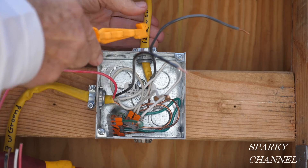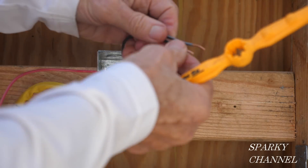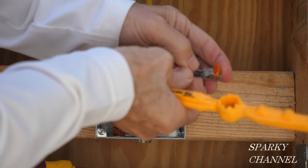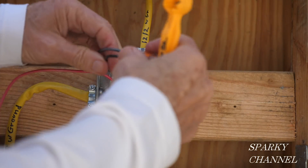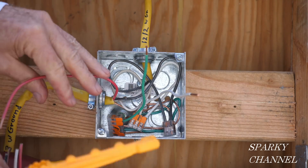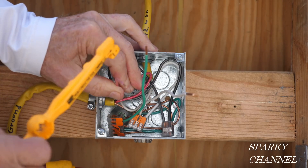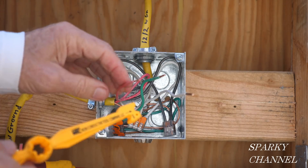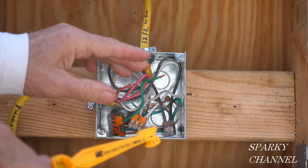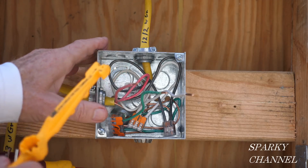This is the cable that brings the power into the box and here's its black wire — this is the line wire. I'm just going to hook that directly to the black wire that's leaving the box, push that into the back of the box. This black wire is not going to get hooked up to the light; that's going to be the function of this red wire — this is going to be the switched hot for the light. The other boxes with the three-way switches will determine whether this wire is bringing energy to the light or not. So: ground, neutral, and switched hot for the light.